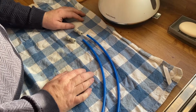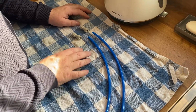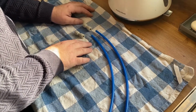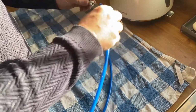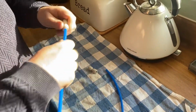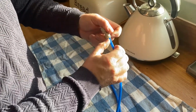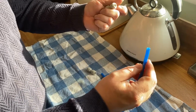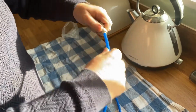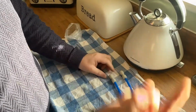Right, so we've got the tap secured underneath now, with all the pipes coming through, and we've got the plastic fittings that will push onto the ends of the two threaded bolts underneath the tap. With a plastic fitting, it's very easy. It's a push fit, like so, and then it's locked in place. To release it, you push in the little collet there, and then pull out the pipe. If you don't push the collet in, then it's securely lodged in place. So we'll push them both in there, and then we'll push them up underneath the tap now.